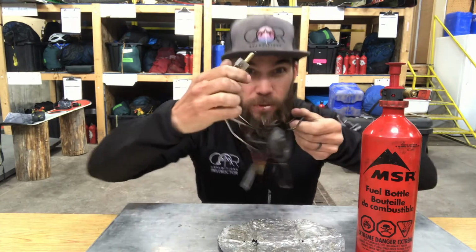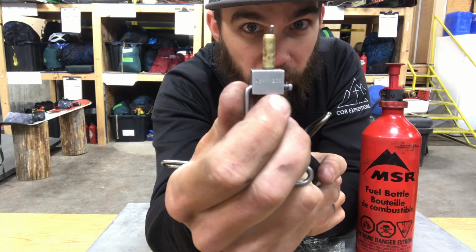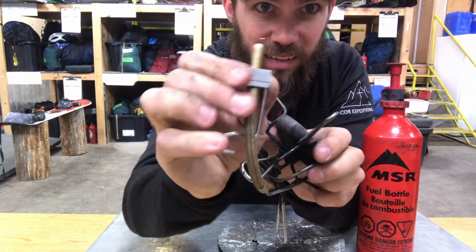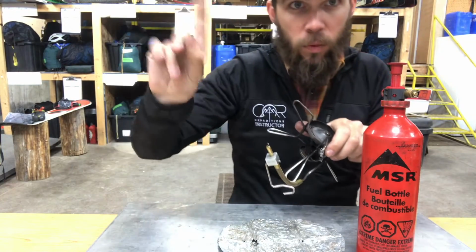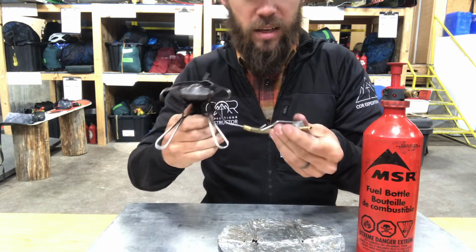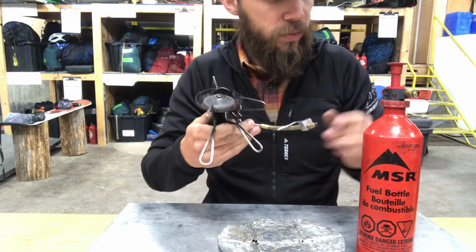Now we're going to take our burner, and if you look at your fuel line, you've got numbers and letters there on one side of this block. It's only on one part of this block. It's not on any other part. And what we say is those numbers and letters should face the sky when we're attaching our fuel line. So what we'll do, you can see this rotates. This makes it easier for me to attach this.